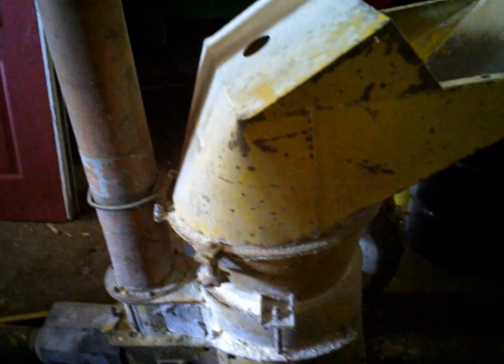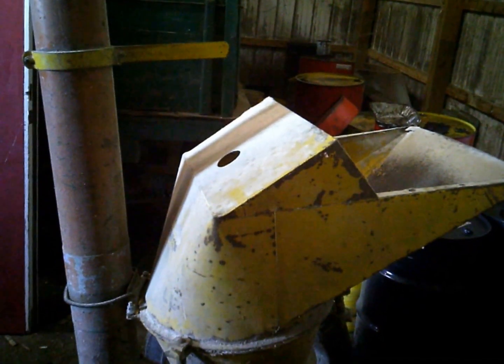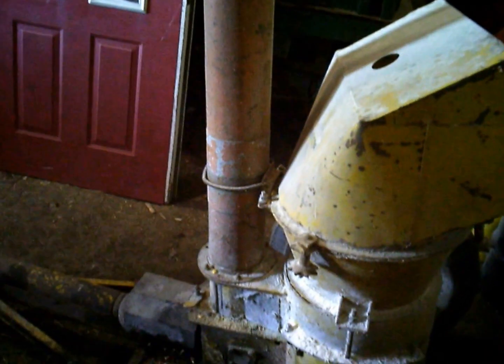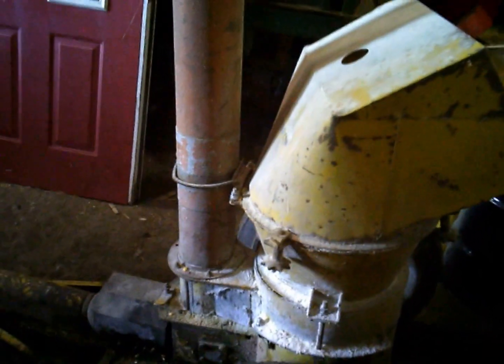You can loosen these knobs and adjust this to whatever side you want to feed corn in on. It doesn't take much horsepower to run — I've seen on a discussion forum that someone ran it with a Farmall Cub, which is like 10 horsepower — so it's not a huge power requirement. It'd probably grind around 150 bushels an hour, as long as you just keep bucking corn into it. My grandpa had 49 dairy cows and 20 beef cattle for a while and used it for years and years. And now I'm using it again, so it's definitely been a good mill.